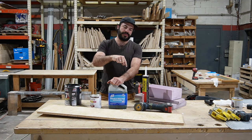And I actually cut this piece of foam a little bit short so that I wouldn't have to make an awkward cutout, and so that my frame, which I've got here, will just sit over that. So the frame is the same thickness as our insulation, and I put an extra lip on it. I don't know, just because it seemed like the right thing to do. This will go in place here. The subfloor will go on top of it, and I'm going to bring my subfloor up to about right here and leave a 3/4 inch reveal, and that way the panel that will go over this will have a nice lip to rest upon.